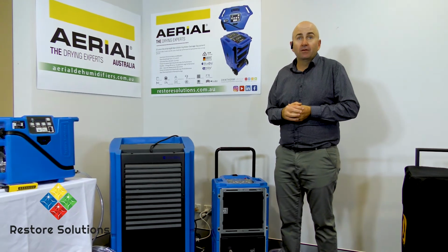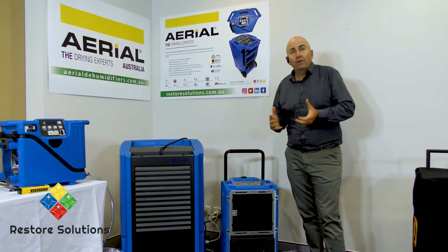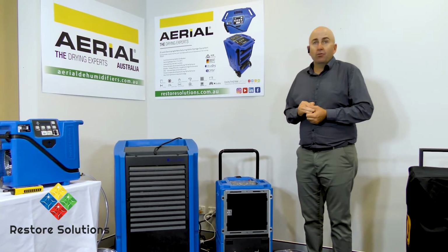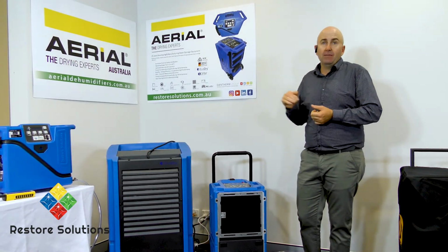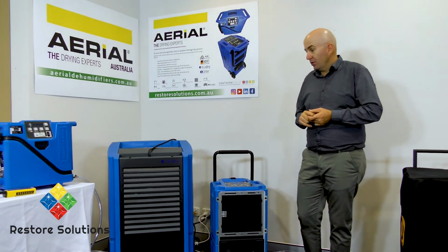Sometimes we're at 35. So what you want to know is, if you check out our website, we've got all of those numbers, what it pulls at different temperatures. So before you decide what sort of dehumidifier to look at, make sure you find out what it pulls at various temperatures, not what it pulls at one temperature. So multiple temperatures are important.